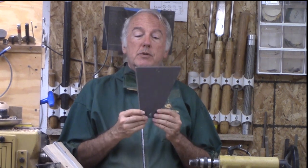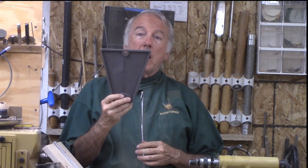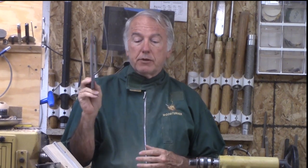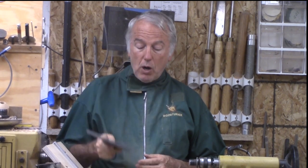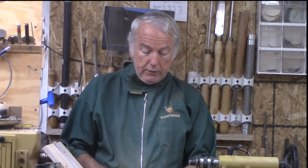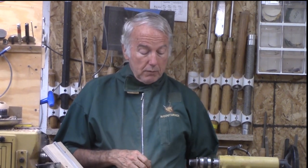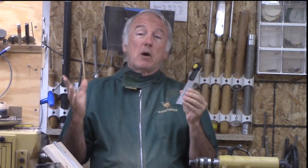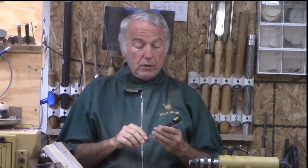To set this sled, I use a template for an angle. This is one that I have designed for 3D printing — I will make it available on a 3D printing share site, so check the description below. If you have access to a 3D printer, you can print your own. You can often find 3D printers in makerspaces or public libraries. What works almost as well, since this process is self-correcting, is a digital angle guide. Either way works just as well and you may find the digital guide to be more versatile.